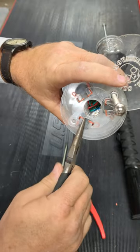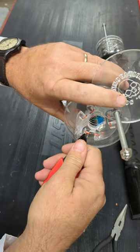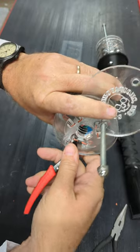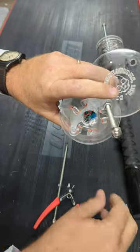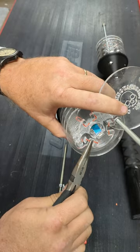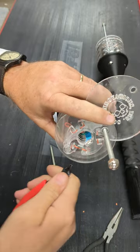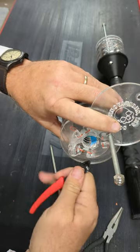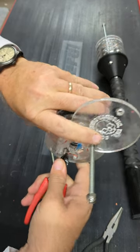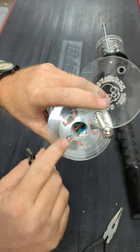I'm going to do the same thing on this side. Pull that up and stretch it in a little bit — it usually works pushing back here at the corner. Push that down in the groove. Pull that up a little bit. Depending on your use, what you'll notice is that as these burn back, they actually sound louder because the arc is going further apart, but they'll do lower frequency — not as high pitched.